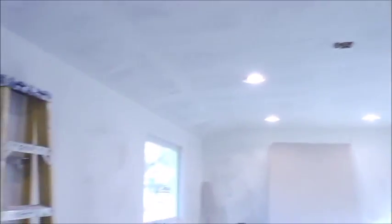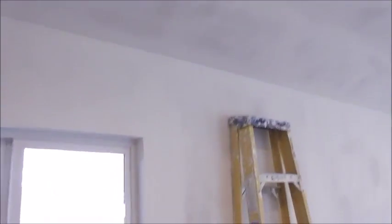I'm going to add some blocking in here to accomplish that, and I think that will be good. Now we're going to go ahead and cut the rest of the drywall and install it here, and hopefully do the taping and mudding today — be able to skim coat on the weekend, then do a final sanding and we'll be ready to talk about flooring. Things have gone at a good pace. It was only the 8th of January, not even one month — the inspector came and passed all the rough-in electrical, framing, and plumbing. We've accomplished all this working basically part-time. Big day today, let's get to it.